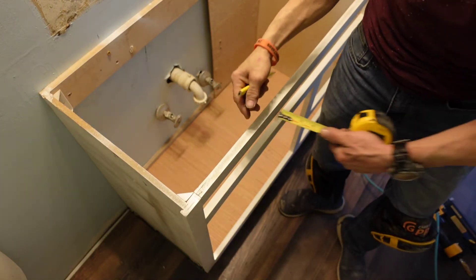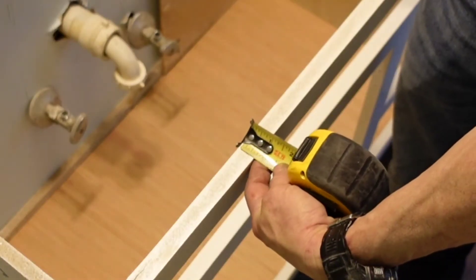To figure out how big these blocks are going to be inside, I just measured this, which is standard three-quarter inch. So we're going to have some custom three-quarter inch blocks so we can nail them to the back of that false drawer front. I'm going to show you how to attach that without having a dry screw going through to the front. I'll be right back.